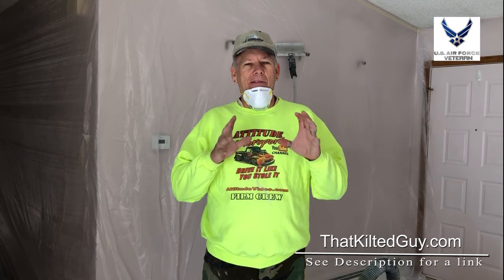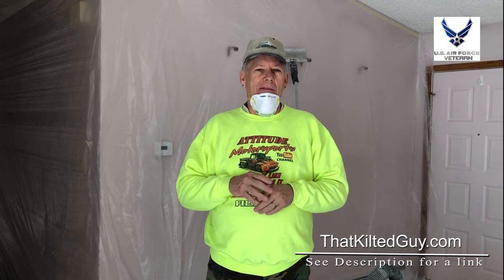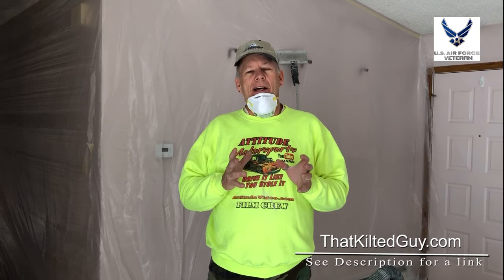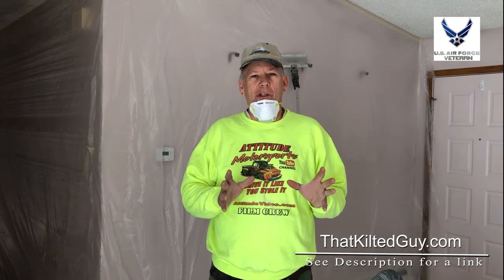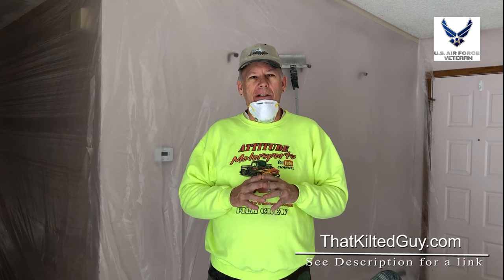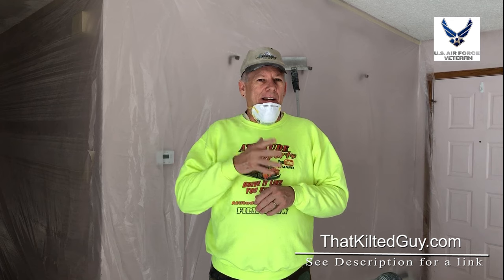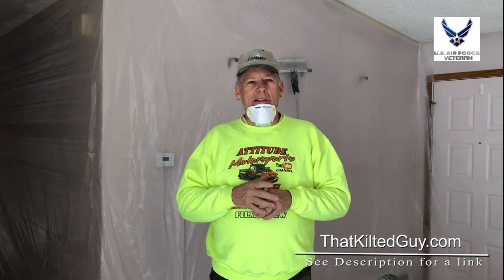What we're going to talk about today is the fact that I've seen videos out there that say don't go to all that trouble of scraping it off with water — just sand it off. Well, from experience having done probably 500 of these, only maybe one to five percent could have been sanded off, and that's because it's usually painted. Once they've painted it, sanders do not like to sand latex paint — they gum up and don't sand well.